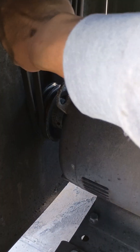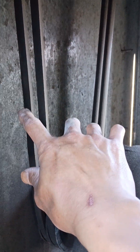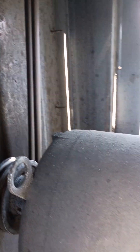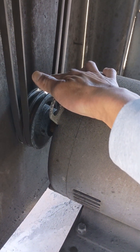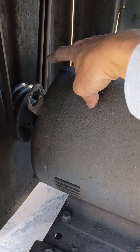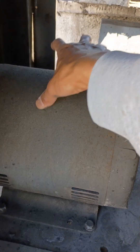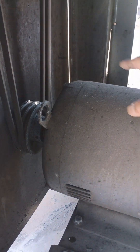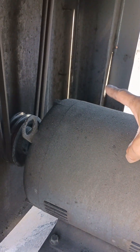Over here is the hood. This motor is about a 7.5 horsepower motor and it's a double belt. One belt is a little loose — actually both are: one is an A69 and the other is an A75. Now that we know our belt sizes, the challenge is that the air balancer told me he could not separate the pulley in order to slow this down. So what I need to do is de-tension this, remove the whole motor, remove the pulley, and hopefully get that to separate — and if that works, we can slow this down.